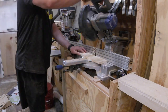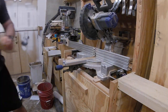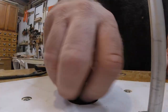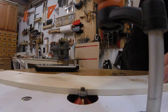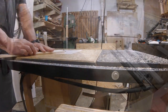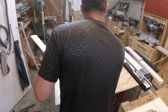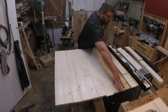Next, I cut those planks into two pieces, making the length of those two pieces random, but I make sure I keep the two sections of each piece together — and you'll understand why when it all comes together. I install a 45-degree chamfer bit in my router table and give each plank a small bevel on all four sides. Then I lay out how I want the pieces to fit on the plywood, using the matched pieces I kept together but in a random pattern. That way, each row is the same length, and I don't waste any more wood than is necessary.